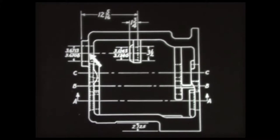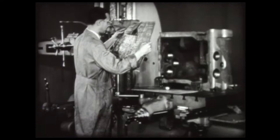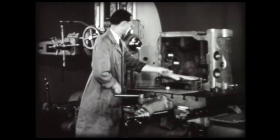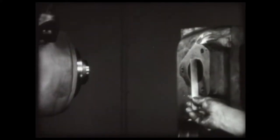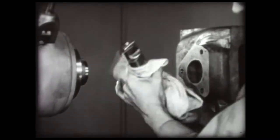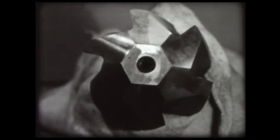The outer hole is cored. Measure the diameter of the cored hole to determine the amount of stock to be removed. The cored hole is three inches in diameter, which means it will be enlarged five eighths of an inch. A core drill should be used here because it has several flutes and will cut truer to center than a standard twist drill.